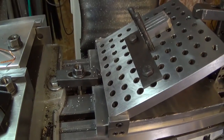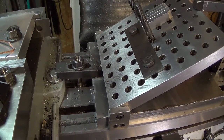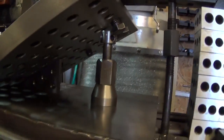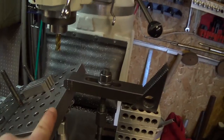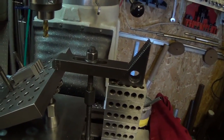I'm going to go ahead and turn it over — the angles on the toe clamps. I've got the angle plate set up and squared on the mill, clamped down. Underneath I'm using the machinist jack and the small triangle to set our 30 degrees, then we clamp the whole plate down to maintain that angle with a stack of blocks and a toe clamp.